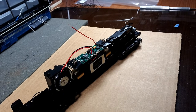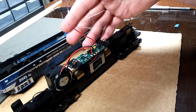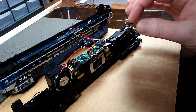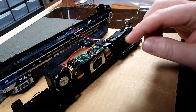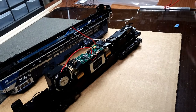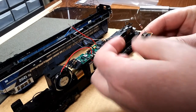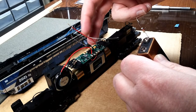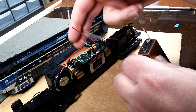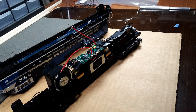If you have any questions feel free to leave them in the comment section and I'll get back to them as soon as I can. The next thing to do with this locomotive is wiring all these connections for the LEDs to the board — real easy to do. Just make sure you're getting your positive, negative, common correct. Test it first with the 9 volt to make sure the LED lights up. With the LEDs I use, the longer wire is the common or positive and the shorter wire goes to the resistor negative.